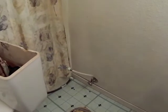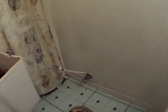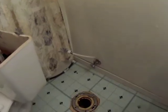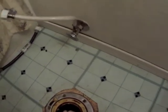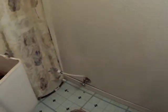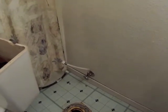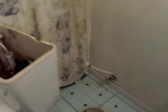I always use the double nut method. You have an extra set of washers and nuts so that you can tighten the bolts down to the flange. That way you don't have to come back sometime and have a bolt that just spins and won't let you take it off. I always use brass bolts. I don't use the plated steel because the plated steel does rust and corrode, in spite of what people who sell them say.